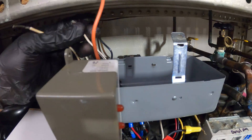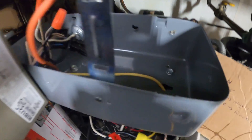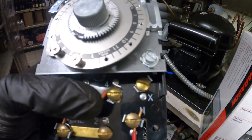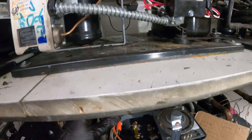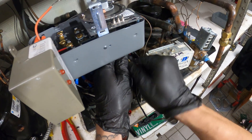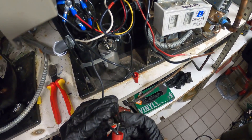Let's bring in our BX — start bringing everything in. We got all this in. These two wires are for our coil, so let's connect that to our power coming in. Our coil is now connected. Then the yellow wire comes in and gets connected here. That orange gets connected to terminal four. Then I'm going to take the red and black wire — line and neutral — and use those wires on my new clock, running that into the control panel. The orange wire needs to go on terminal four.